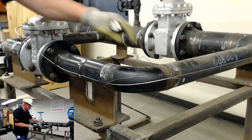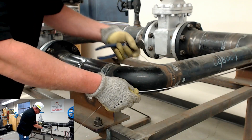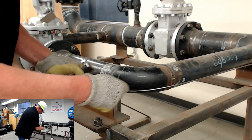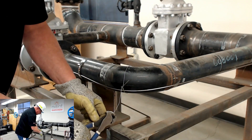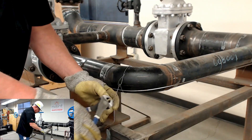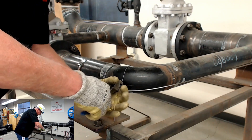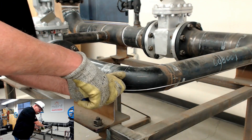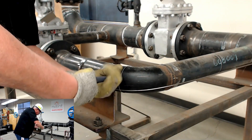The second method we're going to use is stainless tie wire. I have my tie wire here, and I'm going to find the positioning I want with my MI cable. All I'm going to do is just a loose little tight wrap here. Cut my tie wire. I've got my bullnose pliers — they've got the flat head on them. I put it in between the two wires and I pull tension, pulling back on it, because I'm trying to create that tension, and I keep twisting and twisting.